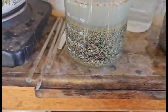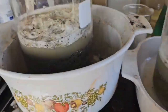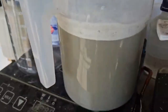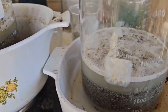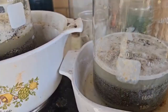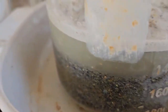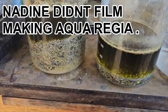It's going to be a tough job. This has been on the hot plate — what we've done was throw it out into here and we're going to filter that while this is still going, because there was too much liquid. I'm going to top it up with a little bit of nitric, still on the heat, and check if there's more reaction. You can see there's still gold in there.